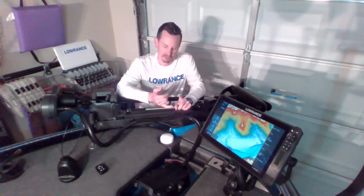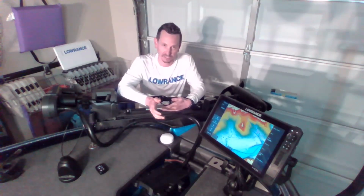Okay, can you eliminate a battery on a 21-foot boat and run it on 24? Yeah, that's a great question. What I'll say is our 24-volt performance is equivalent to what a brush motor is on 36. So the boat actually runs at the same top speed, and with that 60% more efficiency, you can get the same runtime out of your 24-volt system you're used to today. But if you have a 21-foot boat, and you don't want to ever have to worry about the battery all day, I would suggest go ahead and getting that third battery.